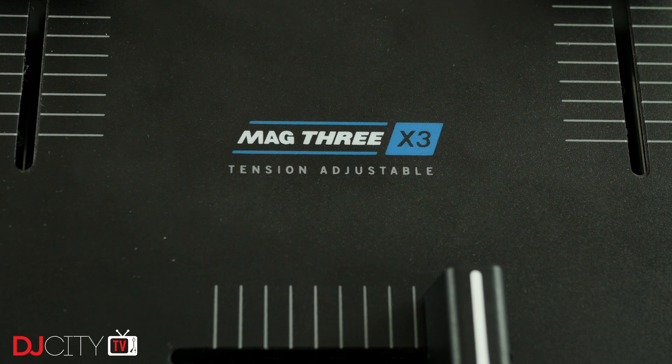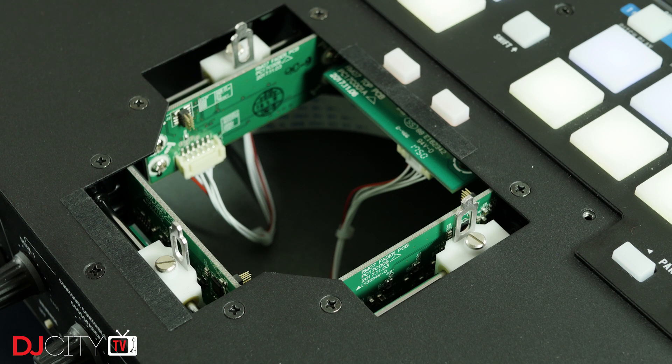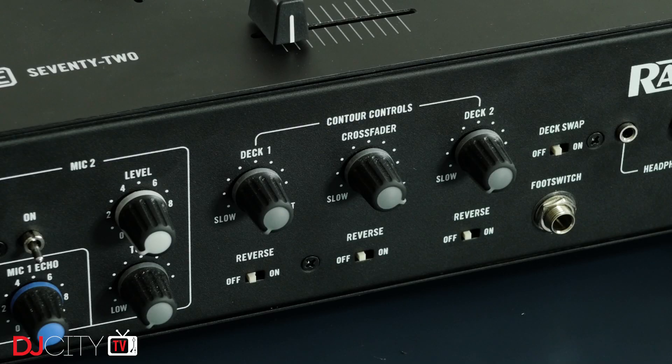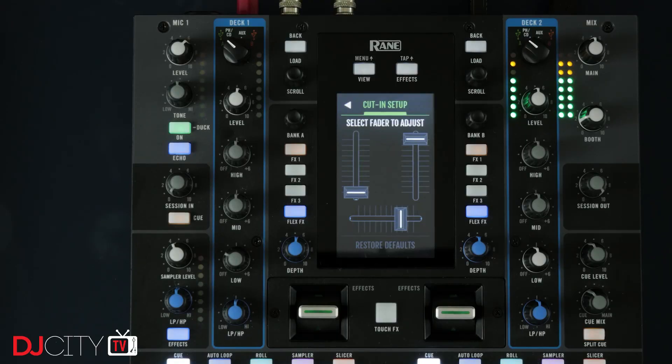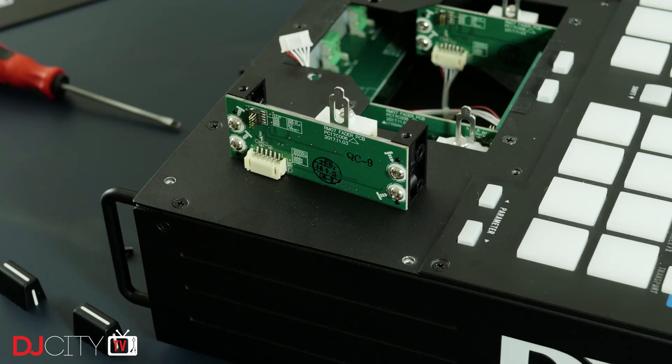Scratching and the art of turntablism have been critical to the success of Rane in recent years, so solid faders were absolutely essential. The last generation of their magnetic faders got a lot of love for feel and performance, but the rate of failure was higher than ideal, with a lot of users breaking fader stems on a pretty regular basis. So the 72 brings the new Mag Three contactless faders to all three slots. The crossfader and up faders are identical, offering a lot of adjustment — traditional knobs for contour on the front panel, cutting distance on the touchscreen, and tension on the fader itself. The feel is superb, durability is promised to be much improved, and having the same quality on the up faders as the crossfader is a big benefit over the DJM-S9 for those who are into cutting on the ups.